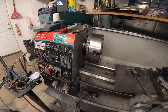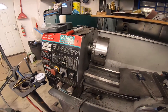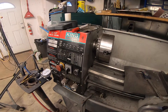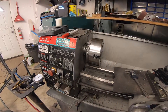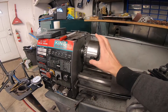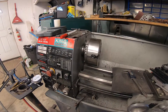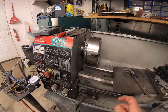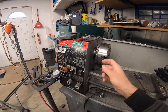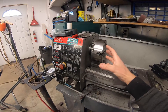Seeing this method, a lot of people are probably going to wonder whether you could balance a flywheel, a fan, or something like that. Yes and no. The problem is that this lathe chuck doesn't have to be balanced terribly accurately. If you're balancing something like a flywheel, you would need something much more sensitive than this, because the lathe itself is so heavy it resists movement and vibration - it actually acts as a damper.